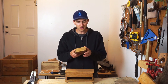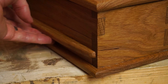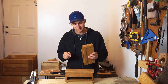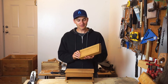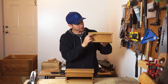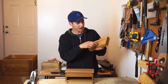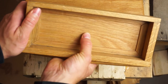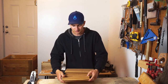This drawer was a lot of fun. It's a full dovetail at the back — the dovetail shows through on the back — but it's a half-blind dovetail at the front, which means you can't see the dovetails from the front. This was my first time making a drawer with this feature, and it was a big learning experience cutting those half-blinds. The way the bottom of the drawer is held in is also interesting — Paul Sellers designed a little strip that goes all the way around, cut at 45-degree angles and glued to the side. This strip has a little groove in it to hold the bottom piece in place, and the bottom piece sits floating in that groove to allow for seasonal expansion and contraction.